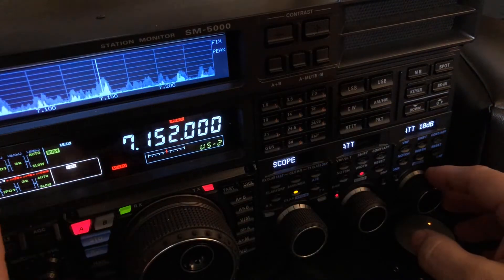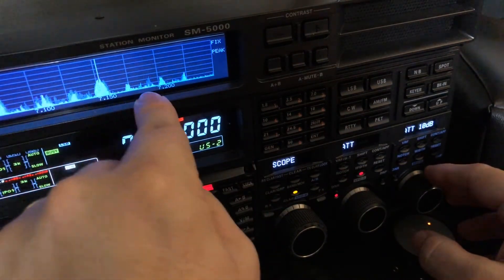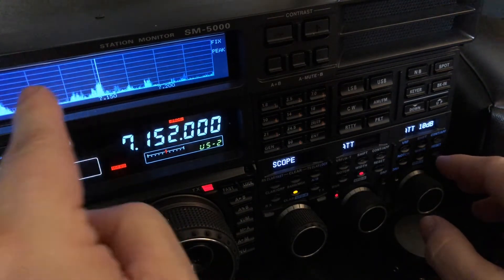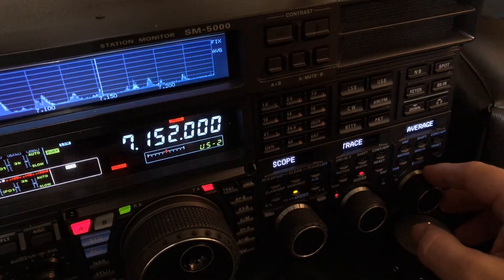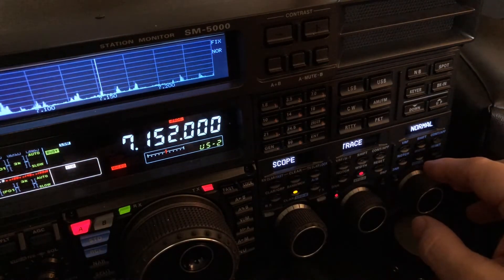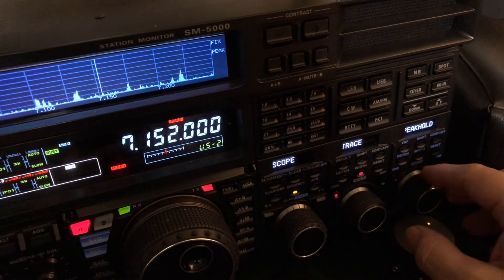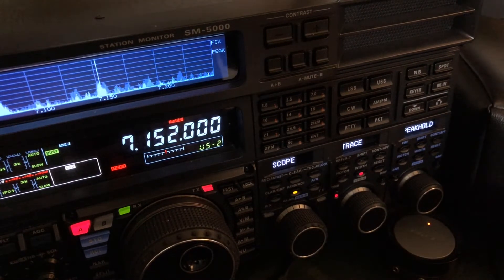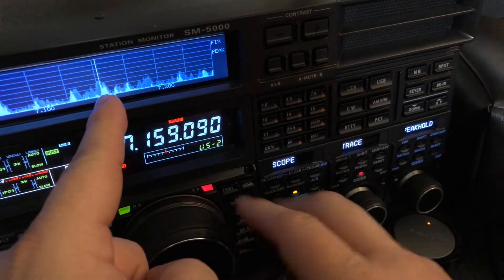I've got attenuation set because I typically run IPO1 and I don't want to see that noise band across the bottom — I only want to see signal spikes. You could argue maybe 20 dB is even better. I do like peak hold: you see the little gray spots holding. The trace can be peak hold, average, or normal. Normal just shows spikes going up and down, but those spikes lag behind the actual signal by a few milliseconds, whereas LBWS mode is more instantaneous. Peak hold is my favorite because when a signal goes away, it holds a gray area, and as you rotate the VFO you can track where that signal was.